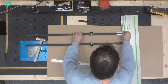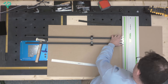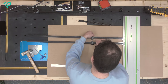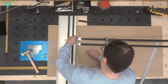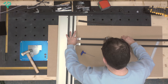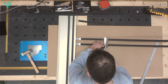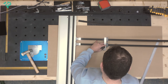Now I'll bring the second rail to close proximity to the first and lock it into place. I'll make sure this one is also bang on the 500mm mark. Since we've calibrated the first, I'll loosen off the second, slide it slightly backwards, then come in with a square I trust — resting on that stop — and push the second stop up to rest on the square, then lock that into place.